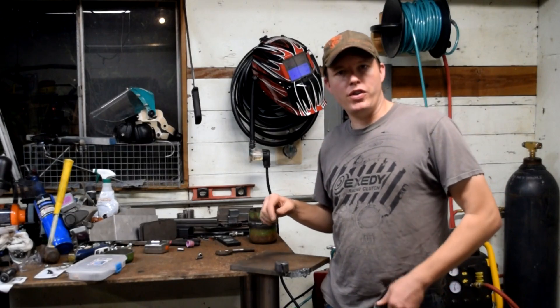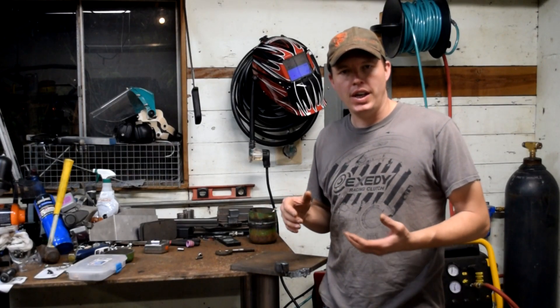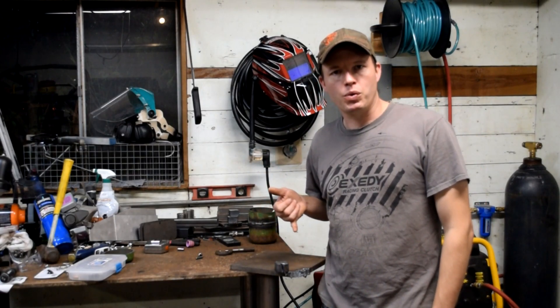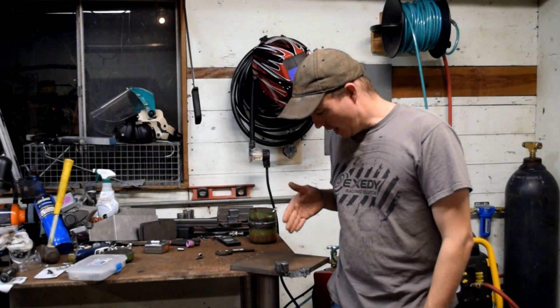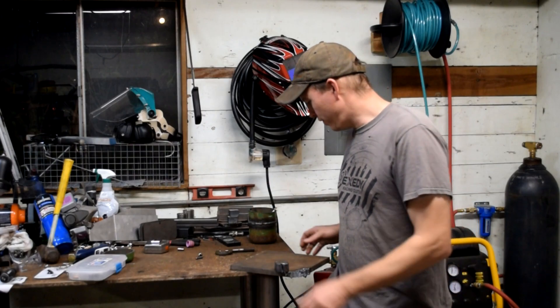All right, so you might have noticed I had a lot of trouble at first cutting the plate. What I ended up doing — I'm not sure if I caught it on camera — was switching out the tip of the plasma cutter, and once I did that I was actually able to cut the half-inch plate relatively well. I mean, operator error — I'm not the greatest at plasma cutting, especially freehand. It's not a super clean cut; maybe other people can do better. But at least it's doable.